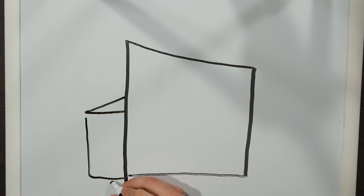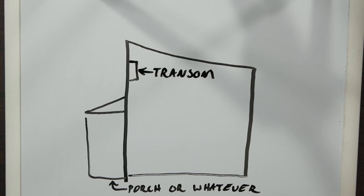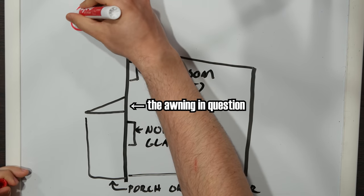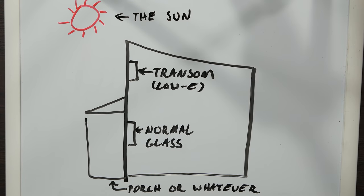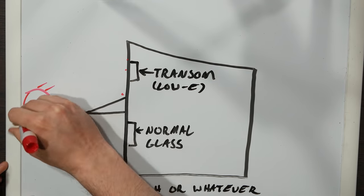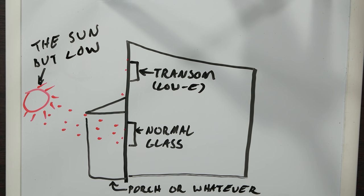There is a solution to this problem incorporated in the passive house design. Because the angle of the sun changes through the year — with higher angles in the summer and lower ones in the winter — we have a workaround. A structure can be fitted with solar control windows up high and standard windows below an awning. In the summer months, the awning prevents direct sunlight from hitting the standard windows, so they don't need to reject IR — it will only hit the transoms, providing plenty of natural light but with minimal solar heating. But in the winter, the sun's low angle now allows sunlight through the low windows as well, providing some free heating. Still, I think developing a window that could reject infrared in the summer but allow it through in the winter is a worthwhile cause — but the mechanism of how the glass rejects infrared is really beside the point.